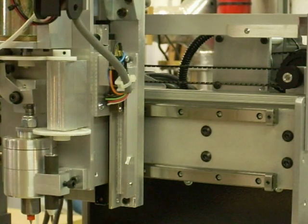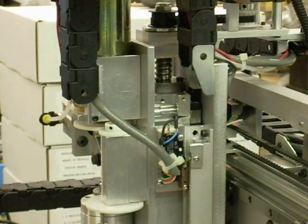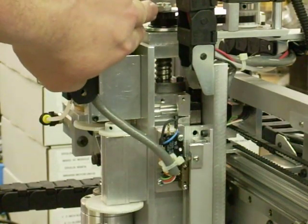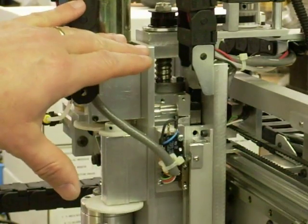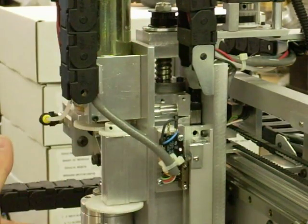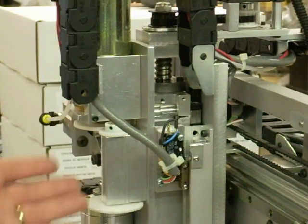So this is a closed-loop system, even though it's using stepper motors for the drive system. The Z-axis uses a ball screw connected to the stepper motor over here with a belt. It's a one-to-one ratio. Pulley comes over here, thrust bearing in there, ball nut there, and then the ball screw there. I used the ball screw for the Z-axis specifically because I needed to drive the load. We've got a lot of weight here, and going with a straight-up belt drive system, I would have needed to add a counterweight to deal with the excess weight on the Z-axis.